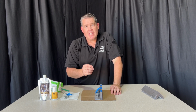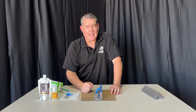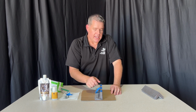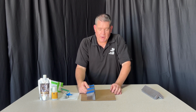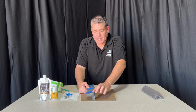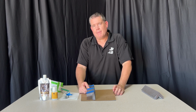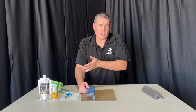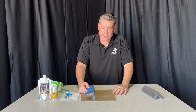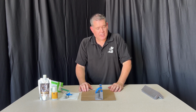The problem is 90% of the time when you have a bad seam or a seam line, it is because somebody did not clean the dirt out of that seam appropriately. And when it comes to porcelain, that is very particular because you are working with very small joints that will be opened up and they will be subject to scrutiny. So make sure you are cleaning your seam ahead of time with acetone if it's quartz, porcelain, or natural stone, or denatured alcohol if it is solid surface. If you guys will follow these steps, you guys will have perfect seams every time.